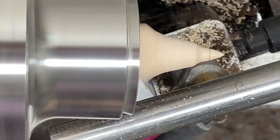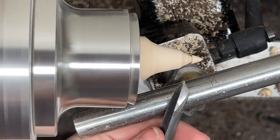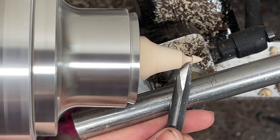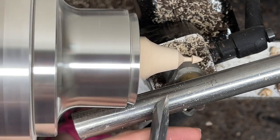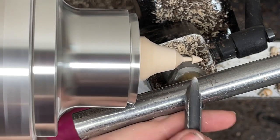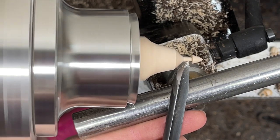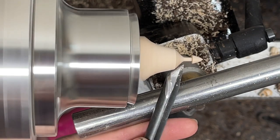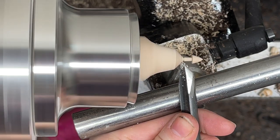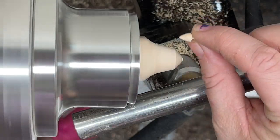I'm basically just turning a taper and then putting a little tenon on the back end of that. The same way we undercut the bottom of the body, I'm undercutting the back of the beak as well, so it sits nicely on the face of the turkey. Cleaning that up really nicely — this detail gouge will end up giving me a really nice clean finish, and especially with the hard maple, I'm not actually going to need to sand it at all. Once I've got my tenon to the right size, I'm just going to part that off, and my beak is also ready to go.